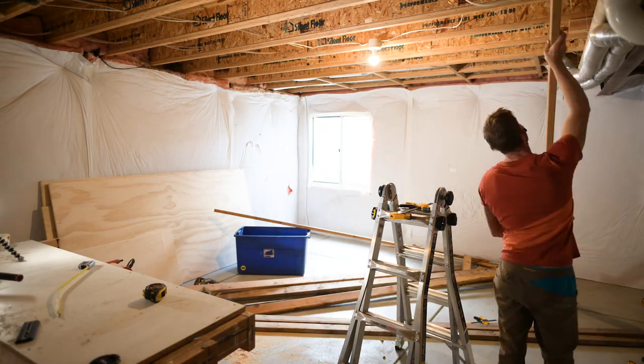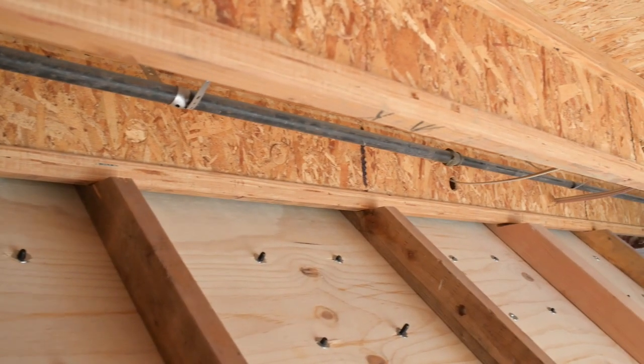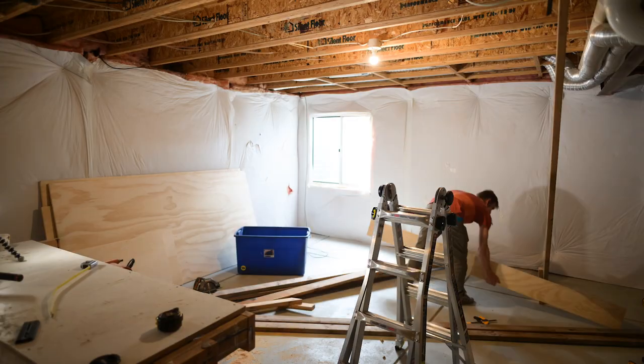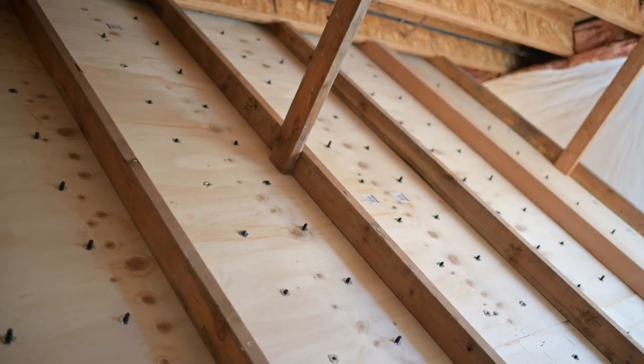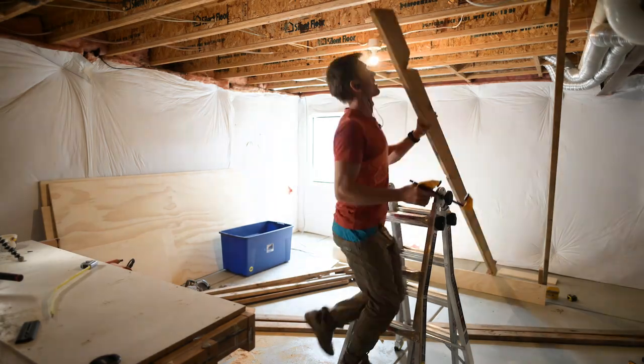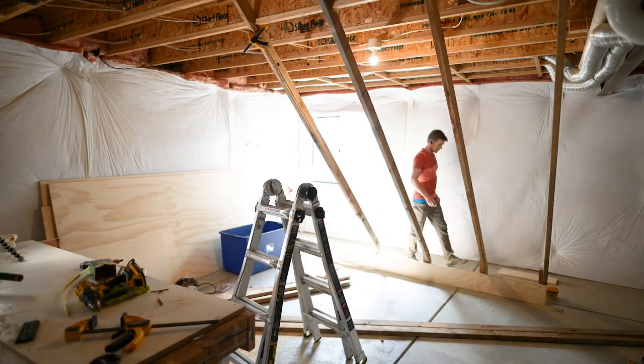Next, mount your first beam by fastening it to the structural beam in your roof with an L-bracket or decking screws. Mount the toe kick as reference now so that you can see where to place your beams so they won't block the T-nut holes. Now mount the remaining beams, securing each at the roof and to the kickboard at the base.